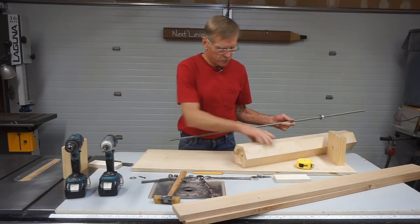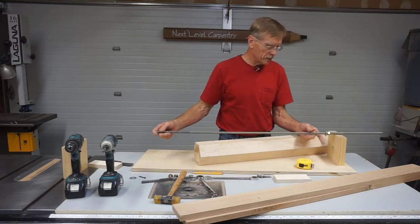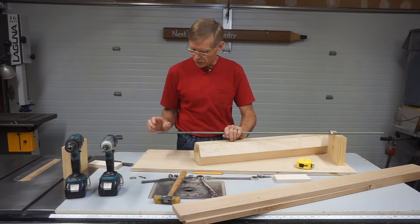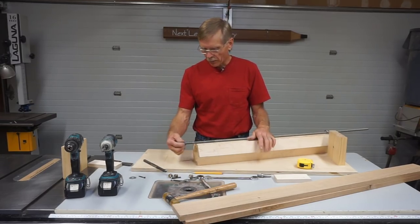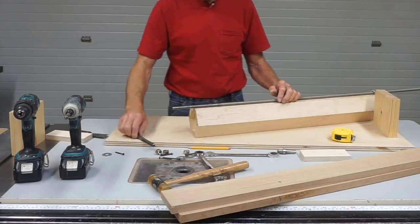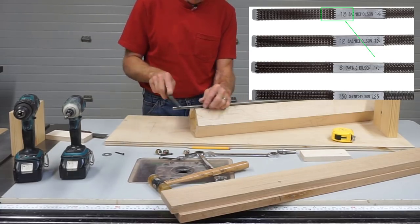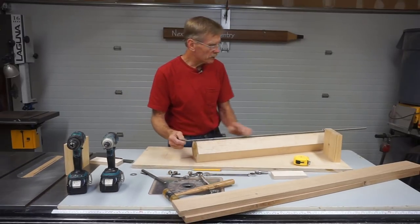Next thing is to slide the threaded rod through those holes, and I've pre-planned this so that this nut ends up inside the block, and there'll be just enough axle on this side for the chuck of the cordless drill to hook on here. If there's any goo or burrs in this threaded rod, I use a wire wheel on a bench grinder, and then I follow up with the number 13 count side on this thread chasing file to make sure that the nuts spin on there nicely.